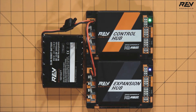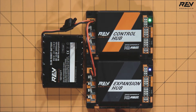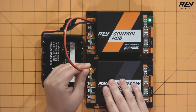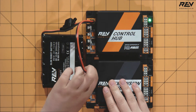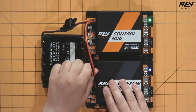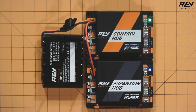The way to check this is to make sure that your secondary expansion hub status LED is outputting a color. If it's not, you're going to want to check your XT30 connection. Go ahead and unplug your cable and go through the process of looking over and checking the connectors and the wiring. Once you've confirmed the cable seems in good shape, plug it back in and do what we call a wiggle test, which is just wiggling the connector in the port. If you have intermittent connection issues when you do this wiggle test, please reach out to support at revrobotics.com and we'll go through the process of troubleshooting this issue with you.